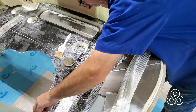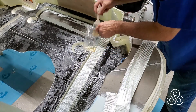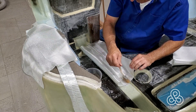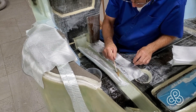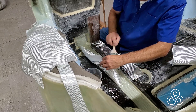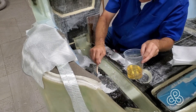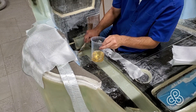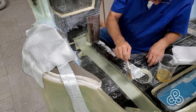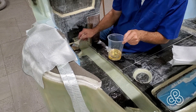Short-lived, because now we're going on to another layer. We're going to go through the same process again — another six layers of unidirectional fiberglass tape laying down in the trough. We won't go through all six layers, but as soon as we've got those layers done, it's back to another layer of cloth. And if you notice, we've gone to a little bit wider now — this one's going to lap three inches or so onto each side of our unidirectional lamination. With this whole trough filled up about an inch thick with laminations, it's a pretty tough piece of fiberglass. In an impact or a rollover, that would easily tear out of the structure if covered by only one or two layers of cloth. So as we keep working these layers up, this fiberglass cloth is going to keep going out wider and wider into the bulkhead and tie the whole bulkhead into a much stronger structure.